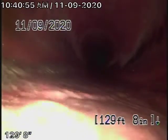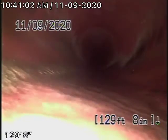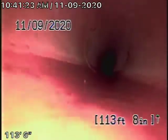We cannot check every pipe in the house — you'll have your general inspector run the water everywhere. You always need some periodic cleaning in the kitchens and the showers, things like that. But we're here to check the main sewer line. Right now we have our camera in the line, and we're actually all the way into the city sewer. There's the city sewer right here — your connection to the city. It's a big six-inch clay pipe coming back from the middle of the street towards the property, and this is nice and clean in good condition.